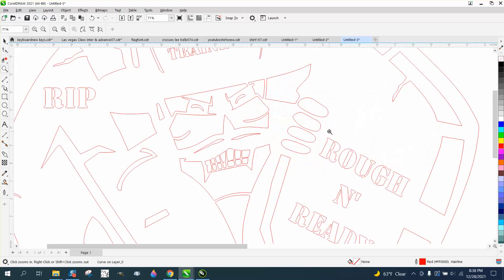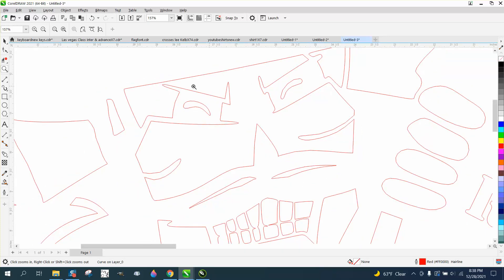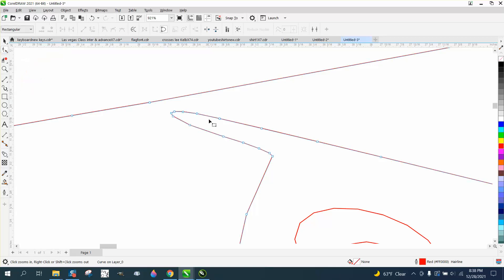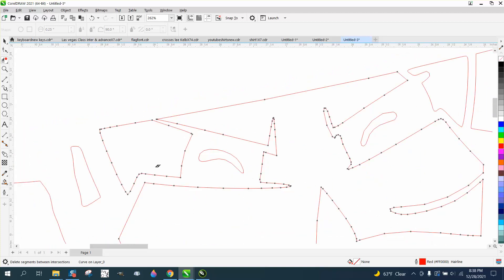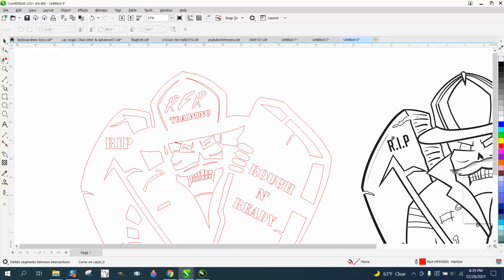On his eye, this piece of metal is just going to be hanging in there — where this has two supports, this only had one. I'd take my shape tool again and zoom in here. There are a lot of nodes for a plasma cutter — let's delete those, let's delete a few more. We're not changing the shape of anything, but then I take this and kind of expand it out, then take the virtual segment delete key and delete those lines. That way the metal is going to be a little bit stronger there, and you just have to go over the whole logo.